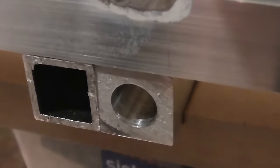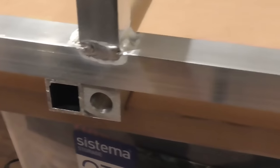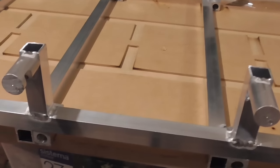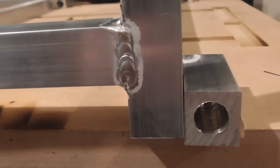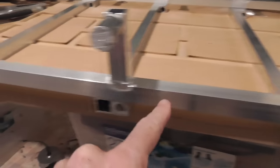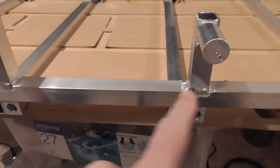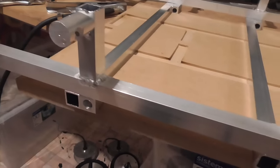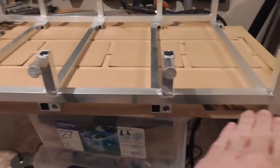In fact, the only places that they don't line up nicely, like this bit here, see this one on the right, that's mostly, I think, due to the miter saw that I have doesn't cut perfectly straight. It cuts sort of on an angle like that slightly. And I think that's the only reason. The other thing that doesn't line up is this one here. You can see vertically, it's a little bit of a vertical offset there. And that's due to the fact that this main beam that goes all the way down here is actually bowing up a little bit like that, and that's probably just due to these welds, because it wasn't like that before. So there's welds along the top here, only on the top, and no welds on the bottom. So what I'm thinking is that when I put welds on here, hopefully that piece there will straighten itself up a little bit again.